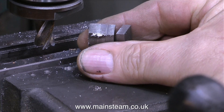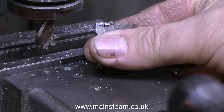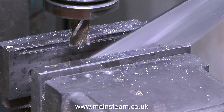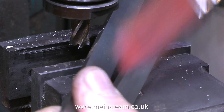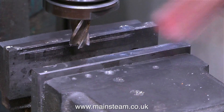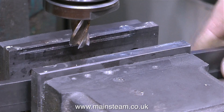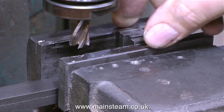As the pieces come off the milling machine, they have burrs on them — these need to be removed before the continuation of the operation. I'm about to reverse these pieces in the machine vise, and if they had burrs on them, they would not sit accurately in position. I'm also taking out the two metal bars, cleaning them thoroughly with a paintbrush to get rid of all traces of swarf, and then cleaning the machine vise itself. Generally my workshop is very messy, but certain areas — like the machine vise — I need to keep clean, as any pieces of swarf in the wrong place will severely affect the accuracy of the job.